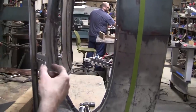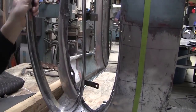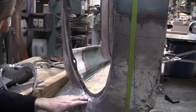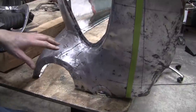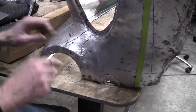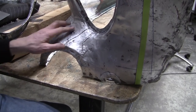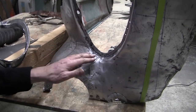There are these little brackets that we took off that attach right here and they're pop riveted on. I de-rusted those and those will have to go back on, so this might need to be tweaked in a little bit. We have to cut these welds down after we still do a little bit of adjustment. We don't want to stress these if we're doing all this heavy, gross moving of the shape with the weld all ground down — it's going to be a little weaker. So we leave them fat like that when we're doing that. We made a bunch of profile gauges and we're going to have to reshape that.